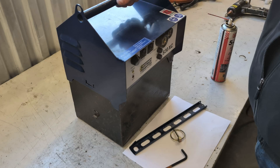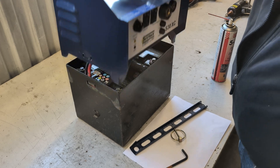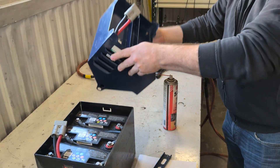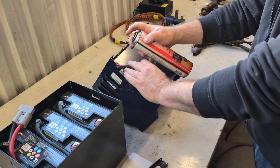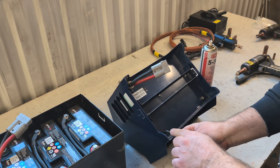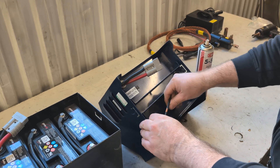Remove the pin and pull out the bar. Lift off the top of the unit and disconnect the batteries. Place the top upside down and spray a small amount of lubrication on the cable entrance as shown. Remove the two screws from the underside of the top.